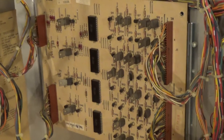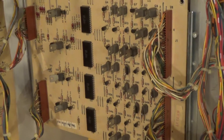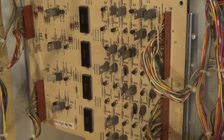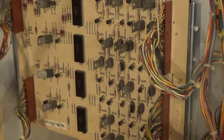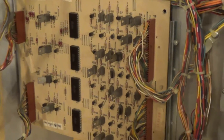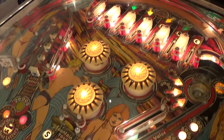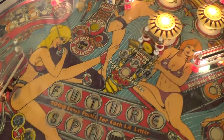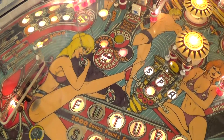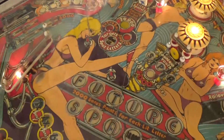But now I'm kind of trying to work on the other one — the one with the lesser issues. This one didn't have as many lamps out. I've been testing it and it doesn't seem to be an SCR issue. I have replaced a couple of those components down here, but it's still having some problems. I think I finally figured out what the issue was. So I went ahead and started a lamp test. If you don't know how to start these lamp tests, go ahead and check out my other video — I'll hit a link at the end of this video — to see the previous work we did on this lamp board.